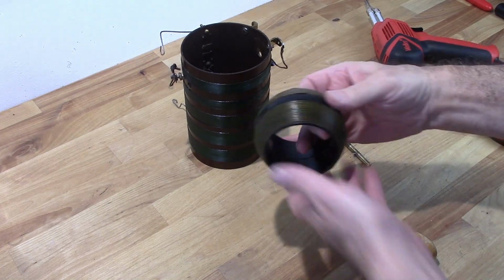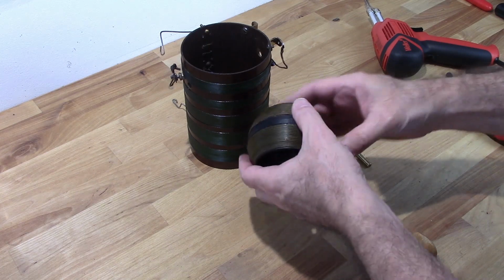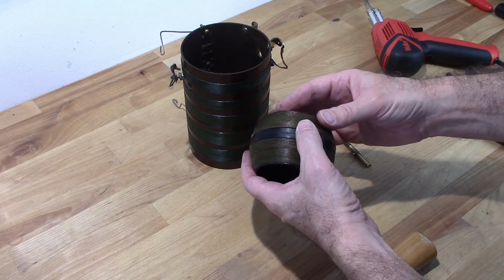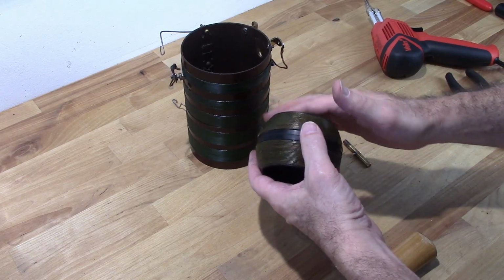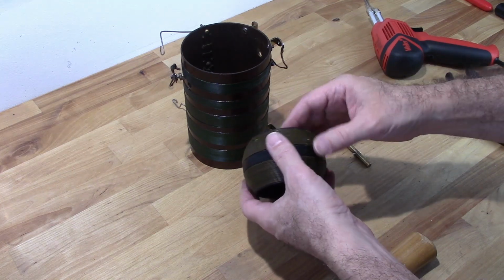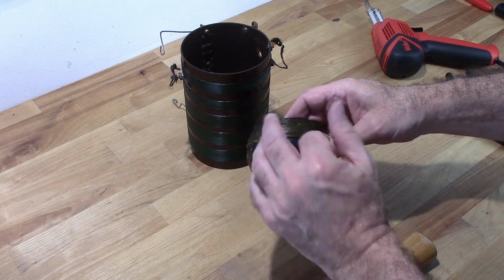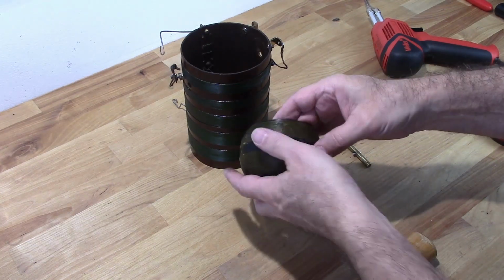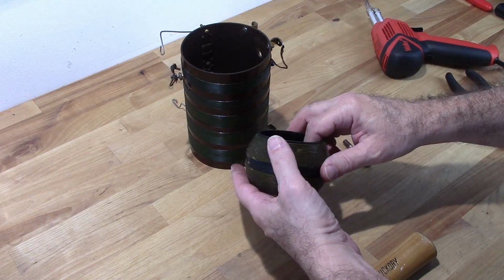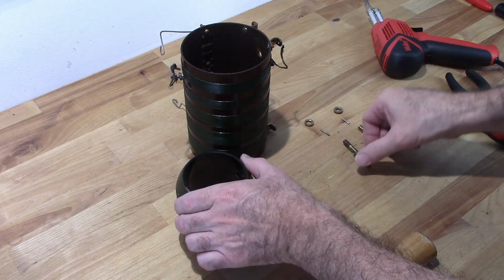Okay, this thing turned out pretty decent. I had to use the RTV because this is an 18 gauge wire. It's very stiff, very hard to work with, and to secure that to this form I really needed something with some strength, so that's why I went that route instead of shellac. If I had all the proper factory equipment to do this, yeah, I could have done it in shellac, but anyway. What I'm going to do is I need to get this thing ready to go.